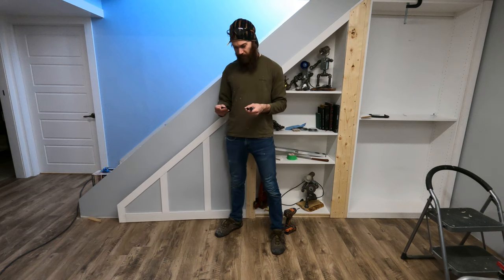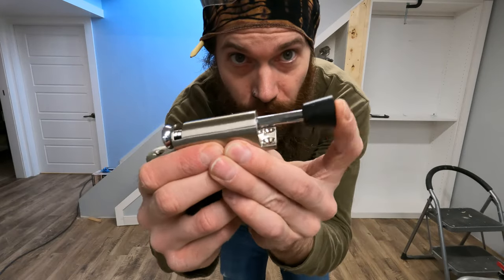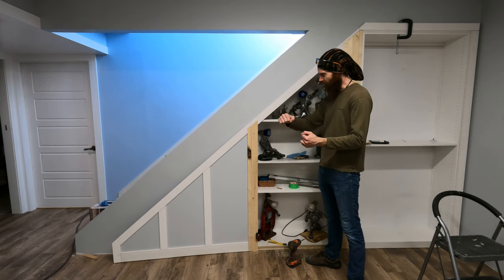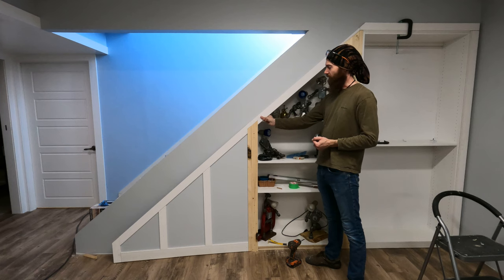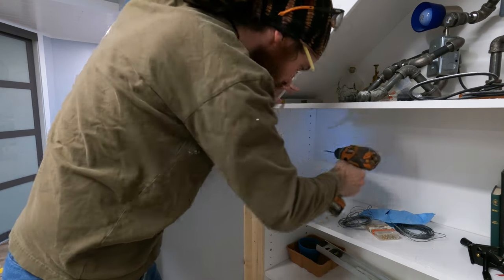To make this thing close and latch, I got a gate latch. I also got a little pusher thing to push it open. I have some wire and some eyelets. We're going to drill a hole and run the wire down so it can activate the gate latch. We can trigger it via a book or maybe a secret thing. Doing a book — we'll drill a hole, get some wire fed through, put some eyelets in, run it all the way down, and that will activate our switch.